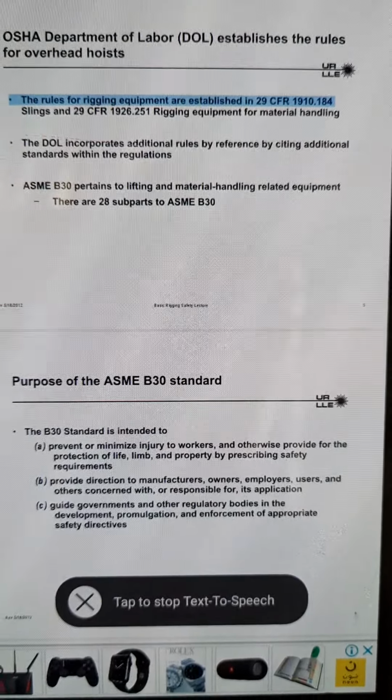Do not use if a gap exists between the part and hoist ring. Do not use a hook larger than the diameter of the hoist ring opening. Never exceed the load rating. Lecture 33. What is the SWL of this hoist ring?